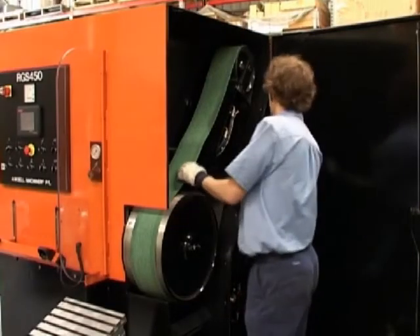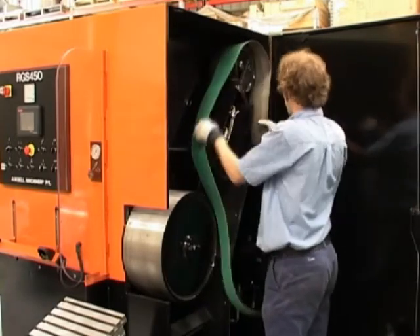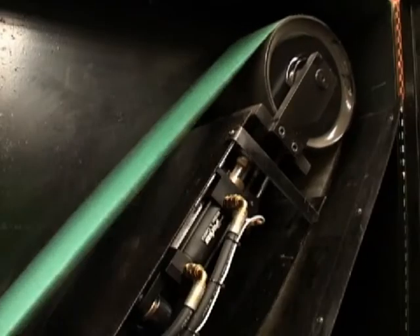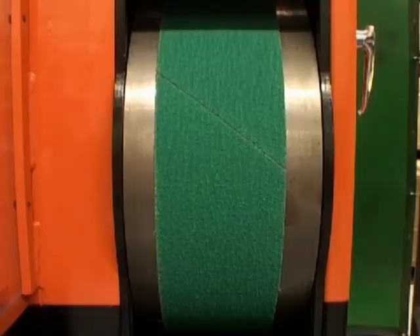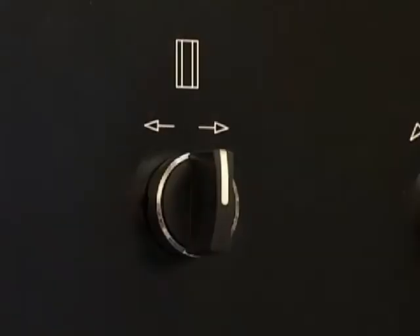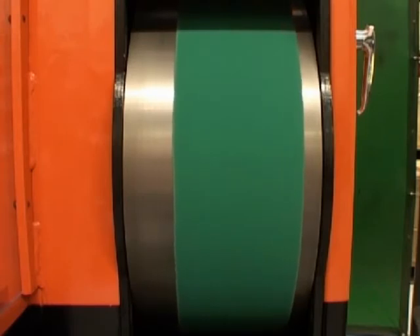Changing a belt is easy. Belt tensioning adjustment is on the front panel. The belt tension force is applied hydraulically and is fully adjustable to suit the grit size. Belt oscillation enables the full width of the belt to be used, giving better metal removal and longer belt life. The oscillation width setting is used to adjust the belt oscillation. The grind rate can be set to suit the alloy, and the operator sets the feed table speed to the optimum grind rate.